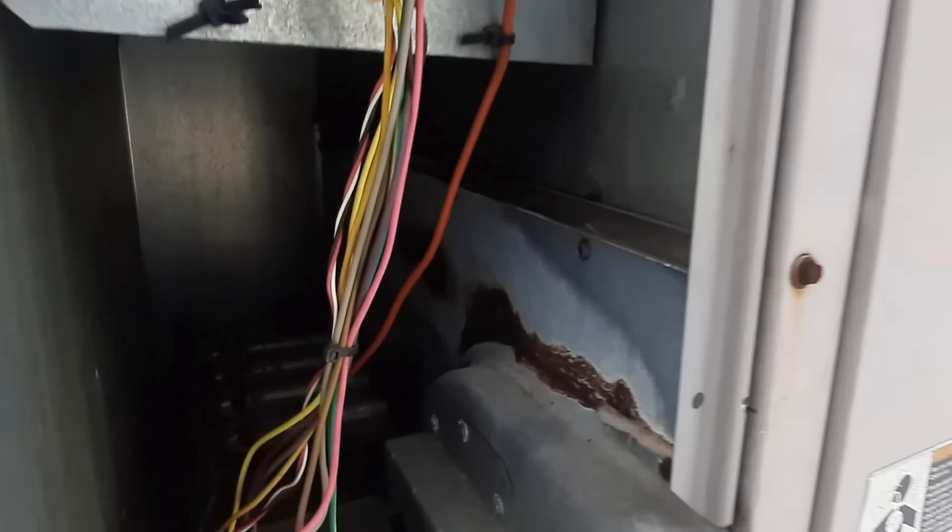Yeah, we're looking at that 60-degree mark, so we are okay on temp rise - at the top end. I need to investigate down inside - is my thermostat reading correctly? It's about 4 degrees colder at the duct than the thermostat was showing. I don't think the thermostat is right - that's a big part of my problem. I need to check if there's a remote sensor, and if not, whether we can set an offset or just replace the thermostat. Also checking where cold air might be getting into my return. Turns out there was a manual return damper on the rooftop that was closed - I got it back open. Both units are heating now over there.